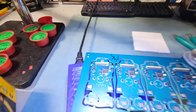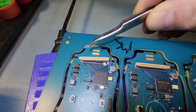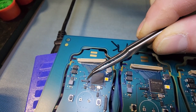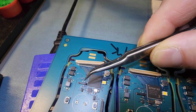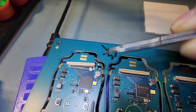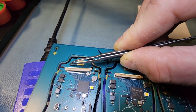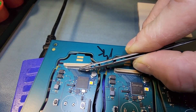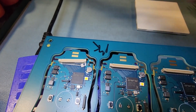We're going to slowly and indirectly bring this up to temperature. I'm going to be aiming the hot air right around this area here — if I hit it directly, the air is going to blast into this part and melt it. We're going to concentrate on this area of copper. There's all copper underneath there, so that heat is going to transfer, slowly wick up, and reflow these pads. That'll let us get that crystal out of there.